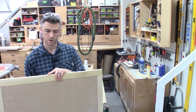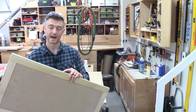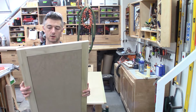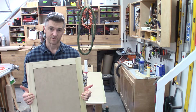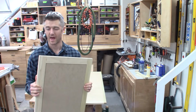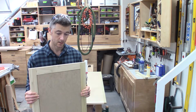And then what I also did was lay these out on the face frame of the cabinet with some reference marks for a 1/2 inch overlay, and then trim these down in width just a little bit. Basically, I'd take off maybe a little less than a 1/16 on each stile to get it to be the exact size I needed. After this, I'm going to drill the holes for the hinge cups over here, and then from there I'll fine tune any more widths, or maybe I have to add a bevel on the center or the end to clear the face frame or clear the other door. But these are all ready for hinges, and so yeah, they're looking good.